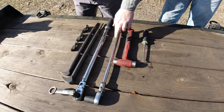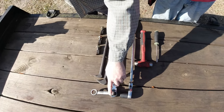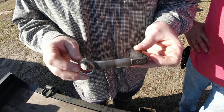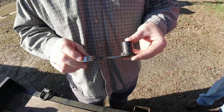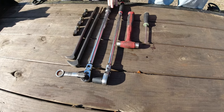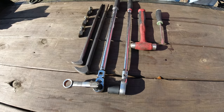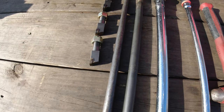This ratchet is going to make getting several of the teeth out easier. However, there's one orientation that's going to be a special case. I've actually built a special wrench to make it easier to torque it, because of the nature of the stump grinder we want to make sure we get it to full torque value at 160 foot pounds. We've got our torque wrench set at 160 foot pounds — that's our final tightening sequence. We've also got two pry bars, lady slipper bars, just to stop the wheel from turning. And of course we've got our teeth — we're going to replace three teeth. You can get six teeth at a time from Woodland Mills as a spare part.